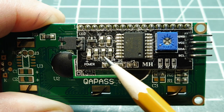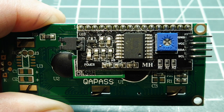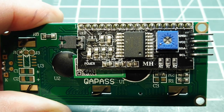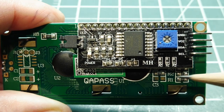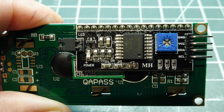If you do not want to remove those two resistors, you could get a voltage converter board that converts 5 volts to 3.3 volts and 3.3 volts to 5 volts, and put that in between the microcontroller and display. But in this case we're going to do a little hack and remove those two resistors. To change the address, there are three address pins — A0, A1, A2 — as solder jumpers. I'm jumpering A2, so the I2C piggyback board address will become hex 0x23.